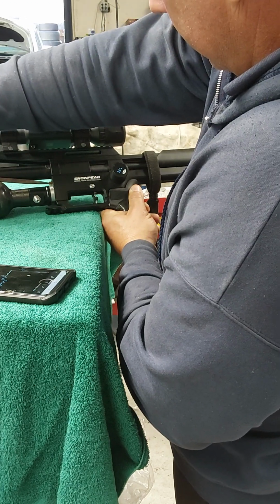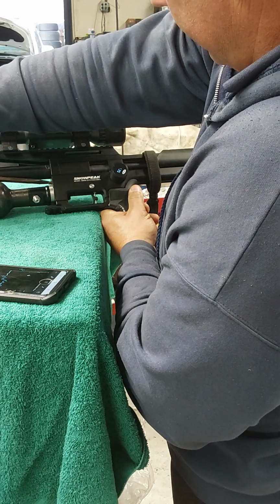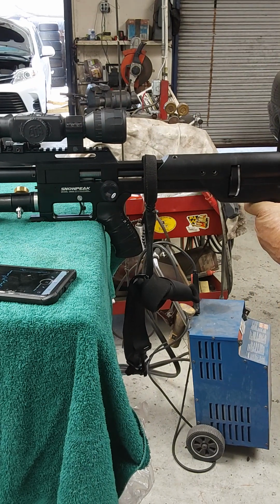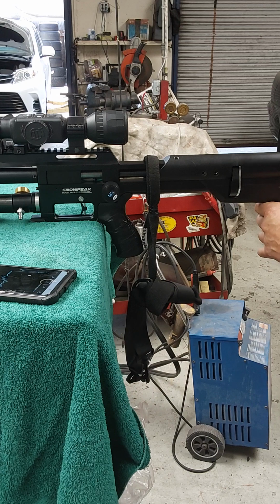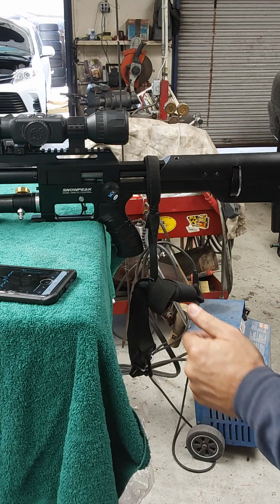180. Oh wow. Kind of excited to see. Okay, we're at about 190 bar here. Now I'm going to go in 2 turns on my hammer because I know it's going to take it. Wow, it's going to take a lot of hammer. I'm at 185 bar there. I just took it in quite a ways. 1007. 1007 at 185 bar.